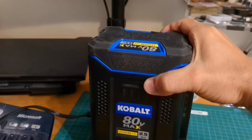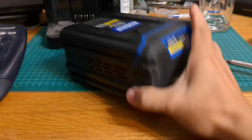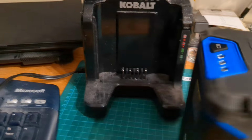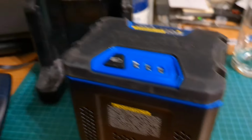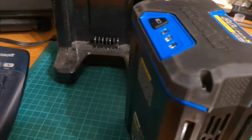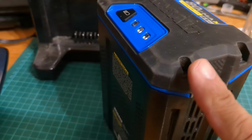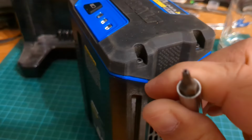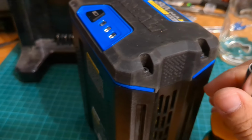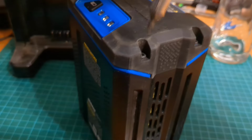Now to do that, to open these batteries, you'll need to remove these four screws on top on the faceplate. And it's like a drawer, it'll slide out. But it's a little tricky because these are T10s, Torx 10 screws, but these are the security screws, with a little stub out in the middle. So you have to get yourself one of these. You'll probably find it in a multi-pack, or if not, I'll put a link in the description. It's always good to have these things around.